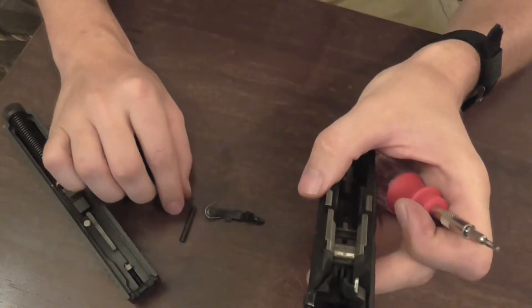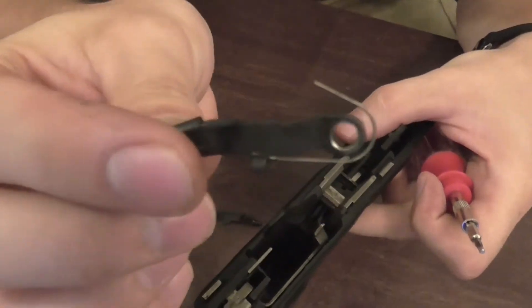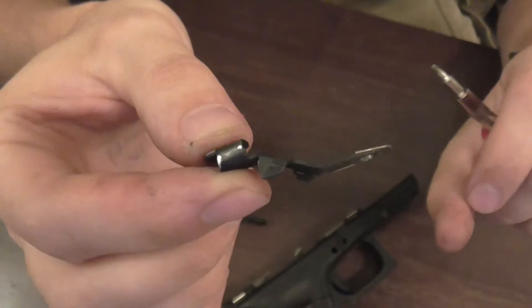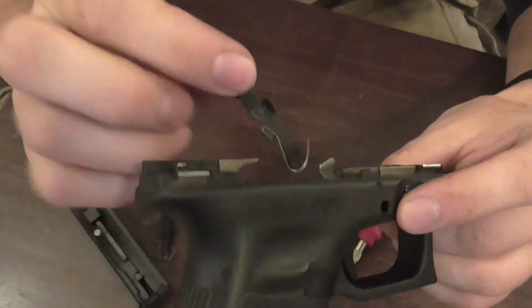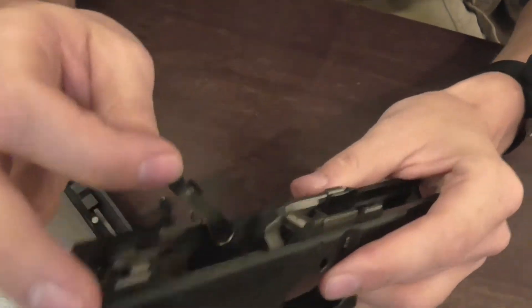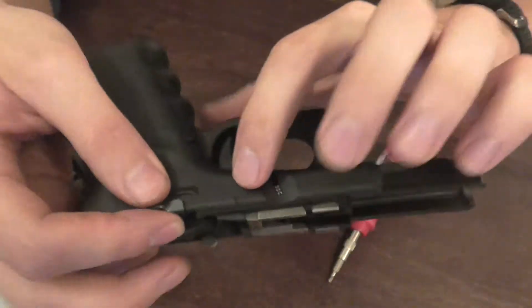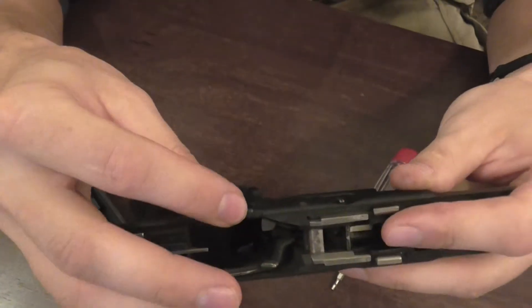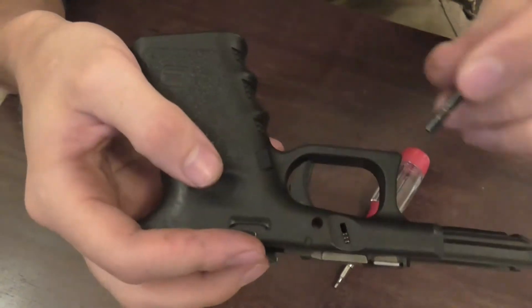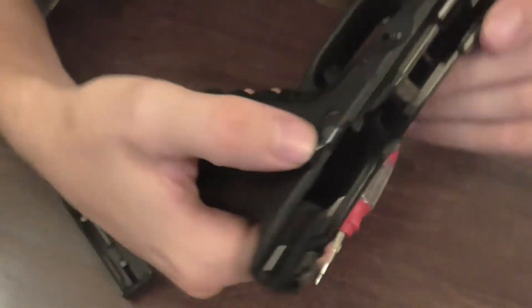I am going to set this pin down. This slide piece just pops right out — it is kind of a spring deal here. We are going to set that down. We are going to put the aftermarket slide release just kind of in the general area. Let us see if you can see in there — you can kind of look through the hole here and see if it looks like it is lined up with this hole. It looks about right. We are going to push the pin through, and then you should feel kind of a springy action when you push up on the slide there.